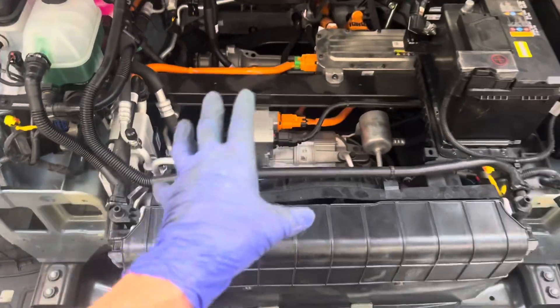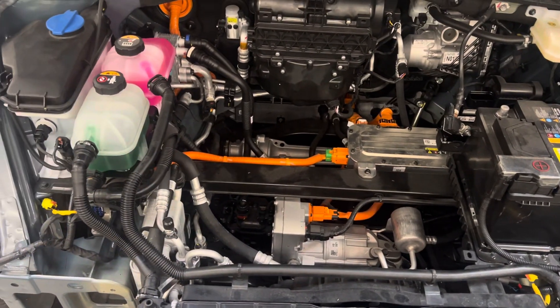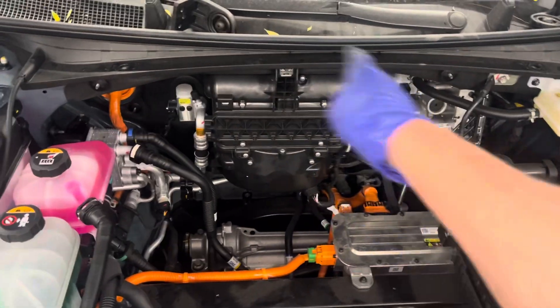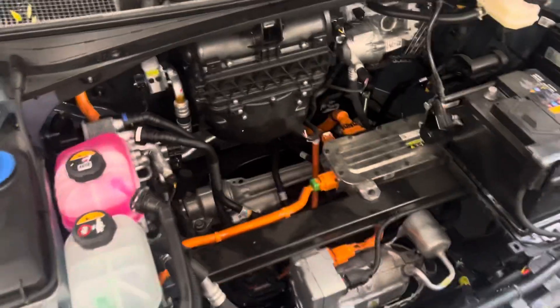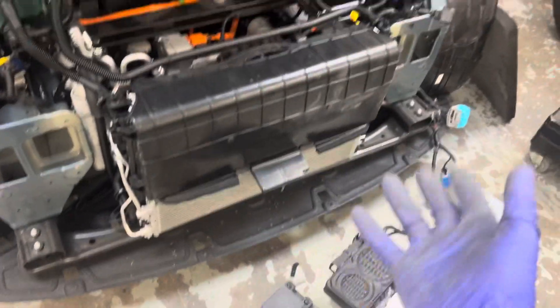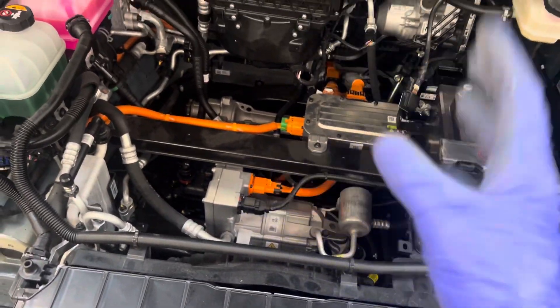Now here's what I would do if I wanted to build my own hillbilly heat pump — I'd go to an old split system or mini-split that's mechanical, pull the three-way valve out of it, do my own piping, and do the hot gas switching using a regular 12-volt or 24-volt solenoid. You could even have it going off to a hot plate. This stuff you could build at home, things could be changed out and replaced with a little bit of pipework and basic knowledge. But yeah — that's how this simple system works. This is one of the simplest, easiest heat pump systems I've seen so far.